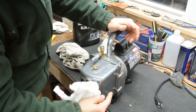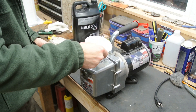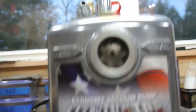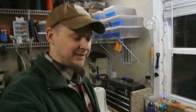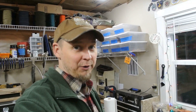Okay, we're all tight. What I did is I made sure I staggered as I tightened — I put all these bolts in by hand just to snug them to the plate, then went ahead and tightened them down in a staggered pattern. Now we need oil. You're going to fill this until you see the level line on the inside of the window they give you. We got that filled — peaked right at our oil level. Next I plug it in, run it just for a couple of seconds to circulate it, shut it off, and then we're good to go. I did drain a little bit out to get the oil level at the proper spot, turned it back on, ran it for a couple of seconds — works out great.